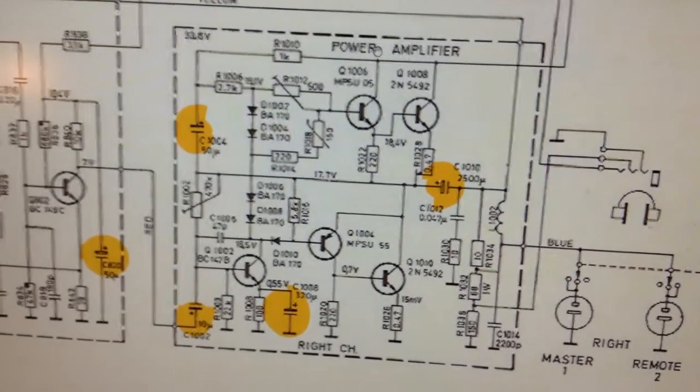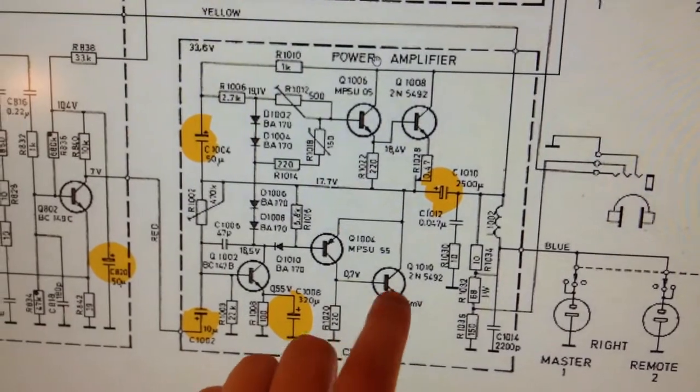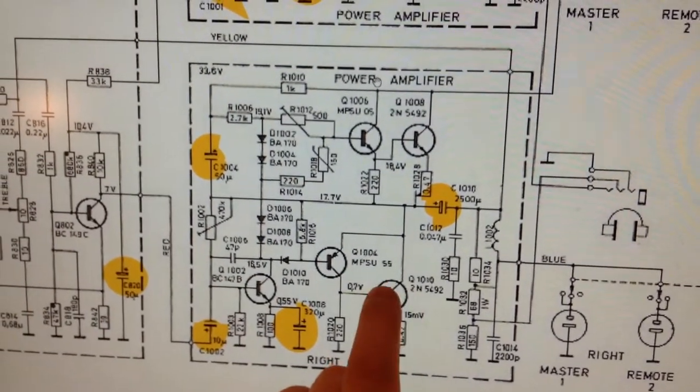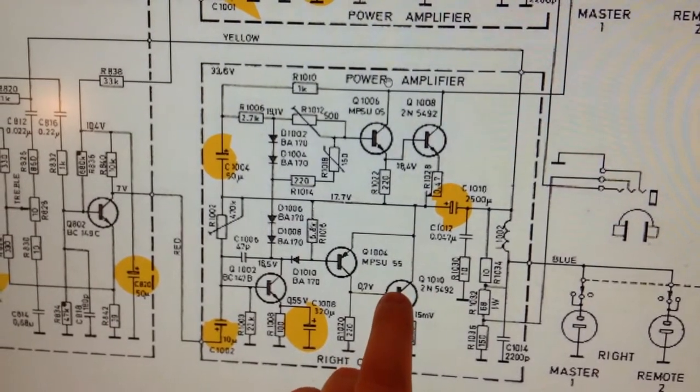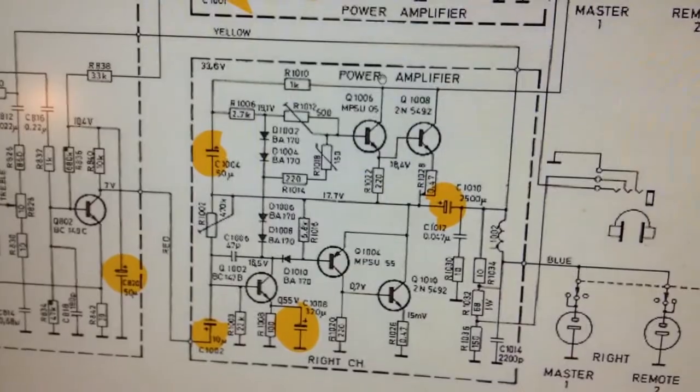Also, something else may be wrong, if you think about it, though it doesn't explain why you get zero here. This mica pad that goes into the heatsink, maybe that one is short-circuiting, so I will check that later.